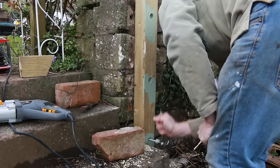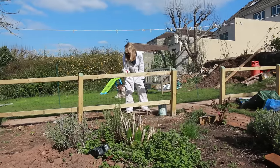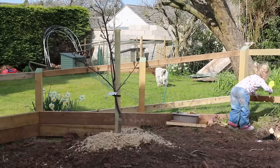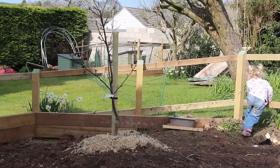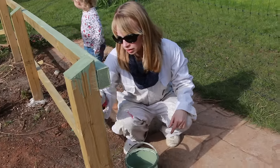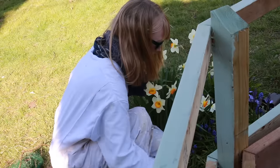I did three bolts on this short post which is probably overkill, but I'm going to put a handrail on there as well so I wanted it to be nice and solid. Then Joe and Eden came down and did their bit of painting - we painted all the posts and rails before we fixed the pickets on, and we actually painted the pickets separately as well. Far easier that way than trying to paint it after it's all been put together.